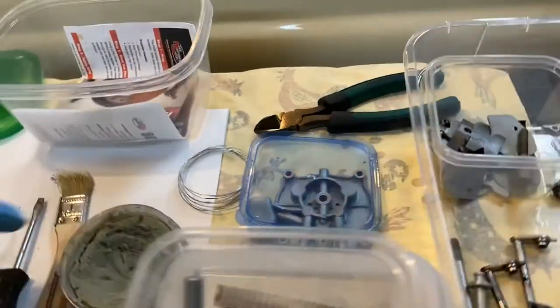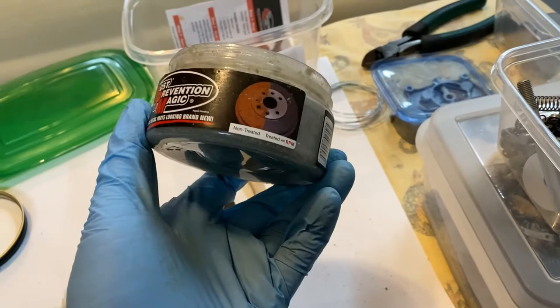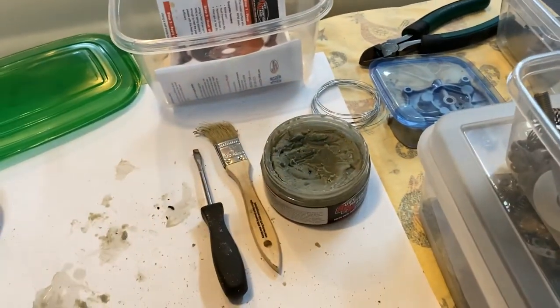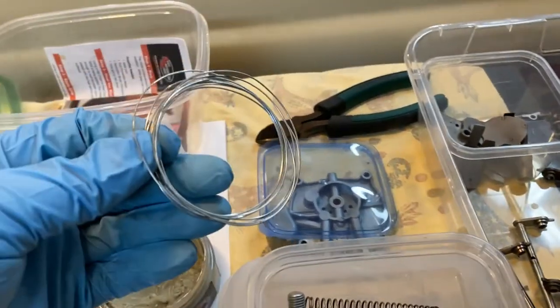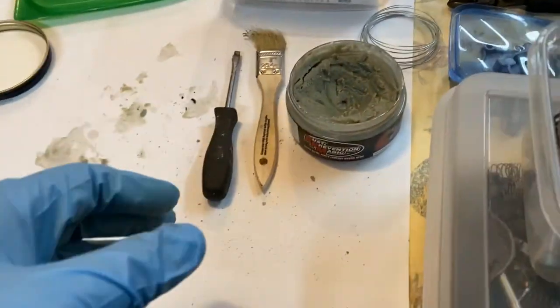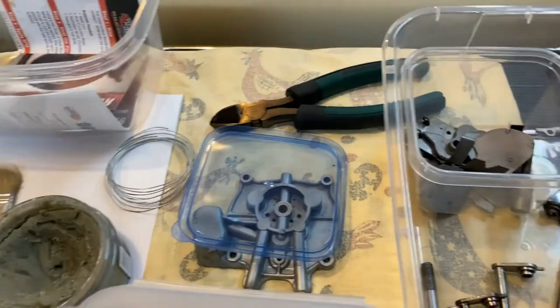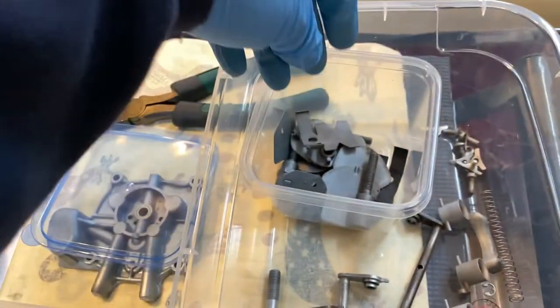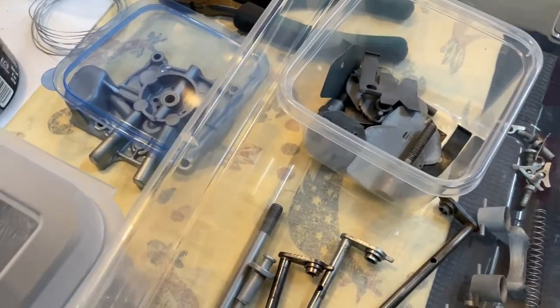Once you do that, I suggest you use a product called Rust Prevention Magic. It's not cheap — I believe I paid about $30 for this little can — but it does a great job coating any bare metal parts that are clean without any rust. I blast them and then use a heat gun or other heat source to heat up the part. I like to string it up with bailing wire. This Rust Prevention Magic really melts into any surface that's been warmed up a little bit, then you just brush off the excess and let it dry. It does a real good job protecting that bare metal piece from the elements.